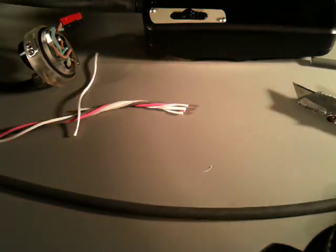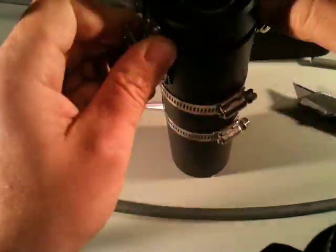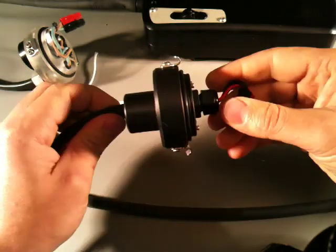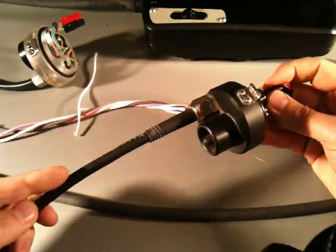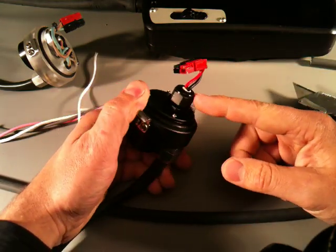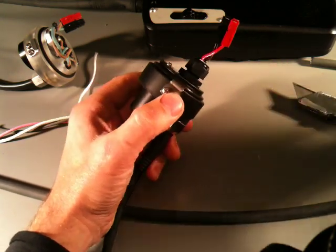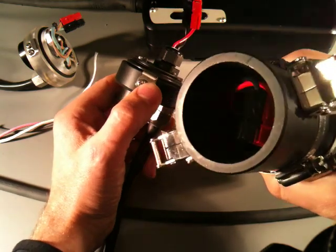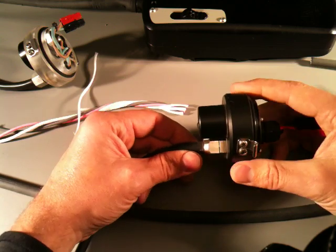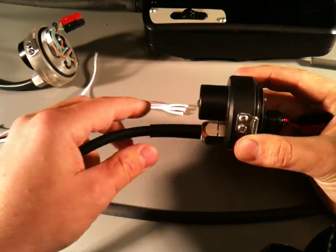Different companies have been working on this for quite a while, but the solution everyone's come up with is sort of the dry sealed canister head. You allow the water to flow down through the cable gland into this head, and then this head is sealed with another cable gland. This potentially stops the water leaking into the canister and getting your battery wet. I guess it is an advancement, but reality is it's a bit of a band-aid, because you've got all of this to solve a problem that starts out here.